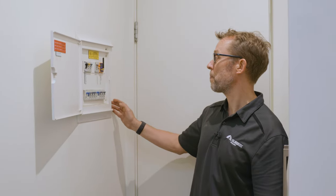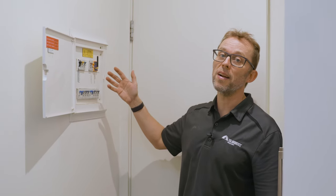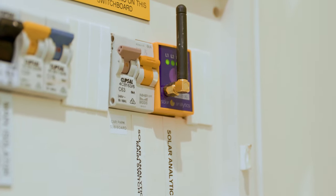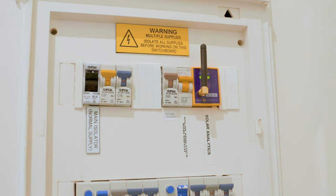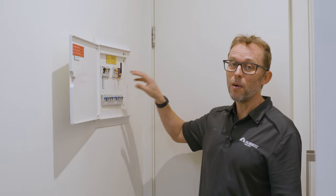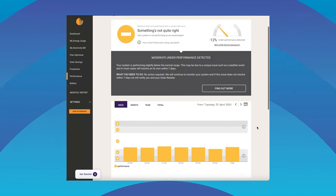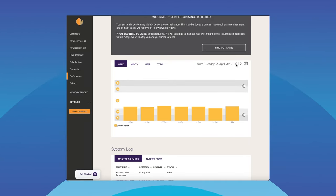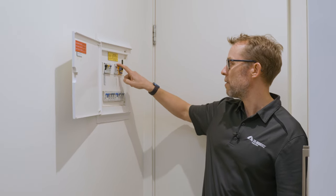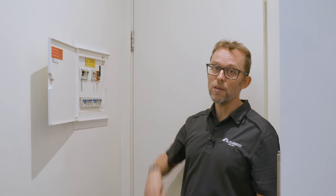This is the unit switchboard upstairs. You can see we've got Solar Analytics hardware in here for the old system. We're moving from hardware Solar Analytics to software Solar Analytics — the great thing is that Solar Analytics software can talk directly to the Sungrow hardware. I love Solar Analytics because it's the only monitoring system I know of that will send you a message if your system is underperforming. Most systems just say it's either completely dead or working fine, whereas this one will flag if you're operating at 75%, so you know to have a look.